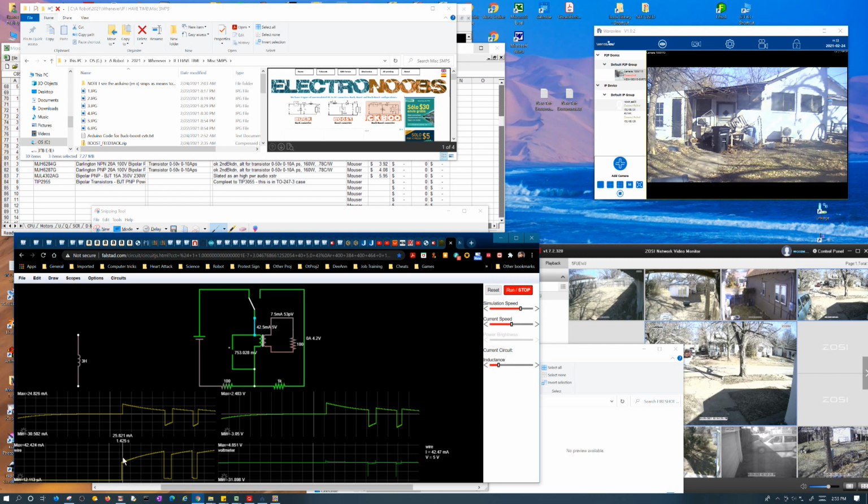Like I said, at first it's getting like 25, it starts at 25 milliamps, but this starts at 25 milliamps and diminishes, so it's almost like the load is getting the first part of this curve, but inverted, reversed. Because really, this starts off where this begins. It's like you're taking this thing, because the impedance is the same, cutting it out and inverting it and putting it here. And this has got to be because they have the same impedance. That's why it's 50-50.